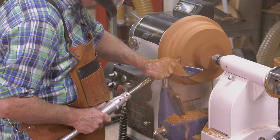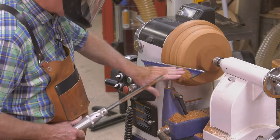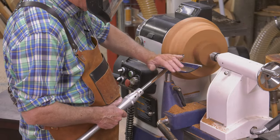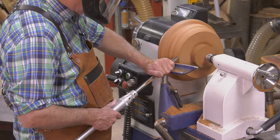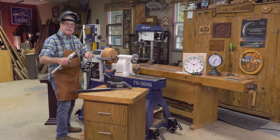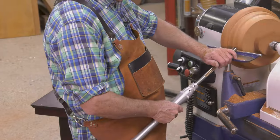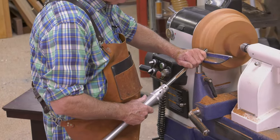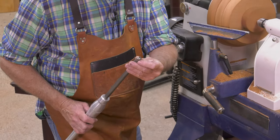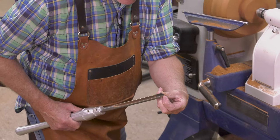What I'm doing right now is called the three-point grip. My fulcrum hand has one job: hold the chisel to the tool rest. There's a nice tray for my palm to rest in — you can use overhand or underhand technique. My dominant right hand controls the height of the chisel and how that bevel — that shiny spot — rubs the wood. Raise the handle, then it throws the shaving from that little spot right where my fingernail is.